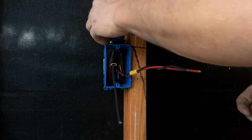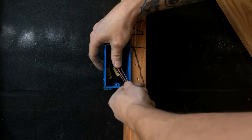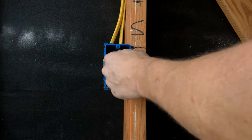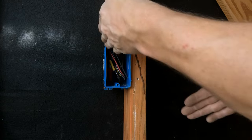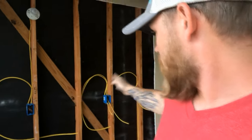I'm going to get these accordioned down, accordion up, and figure out what length I need to cut them. Something I do - and you don't have to - I like all of my wires to be coming down from top left to bottom right at a 45-degree angle. That way, if you ever have an inspector come through and walk the house and he goes and looks at every box, every single plug when it's ripped out, all the wires are at an angle. It just looks really, really neat. An inspector will look at that and be like, wow, this guy's really neat and clean, he does good work.